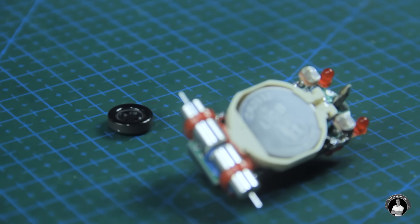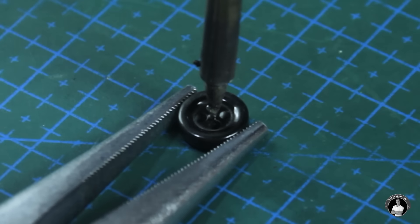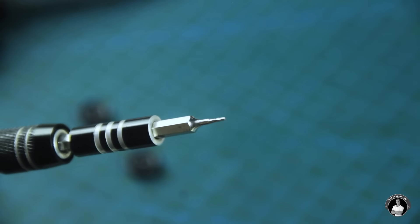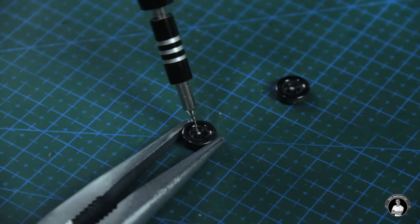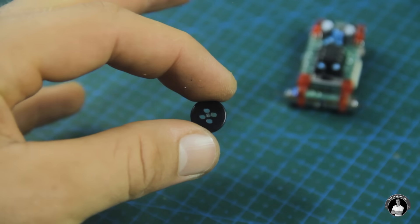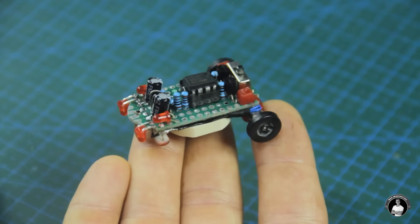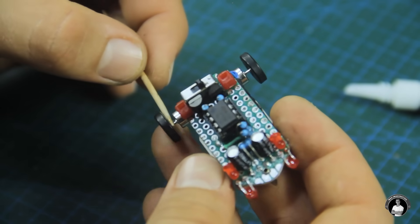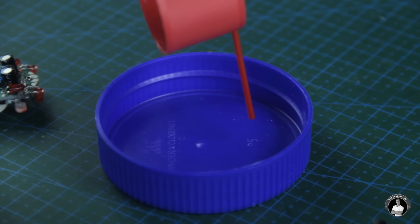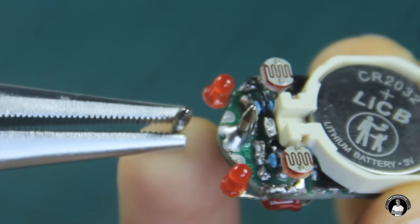For the robot's wheels, we'll be using two shirt buttons. To make the necessary holes, we'll begin with a light center punch in the middle of each button with a soldering iron and continue making the holes with a 0.5mm screwdriver tip. Both wheels should slide on with a tight fit. You may also want to carefully superglue them onto the shafts without dripping glue into the motors. If the pen caster wheel doesn't roll too well, only if it's very seized may some oil help.